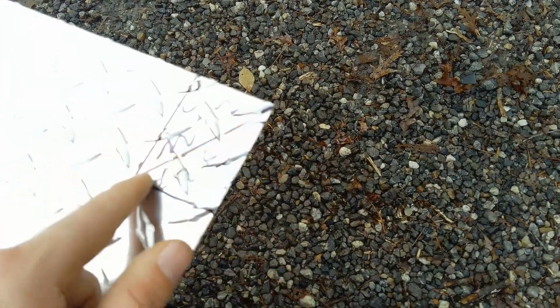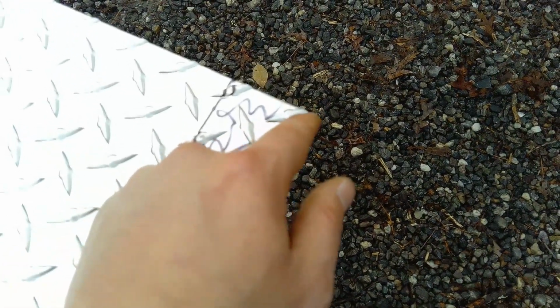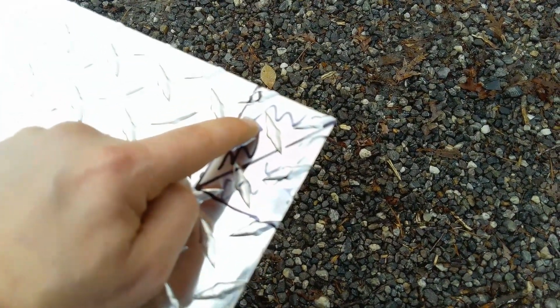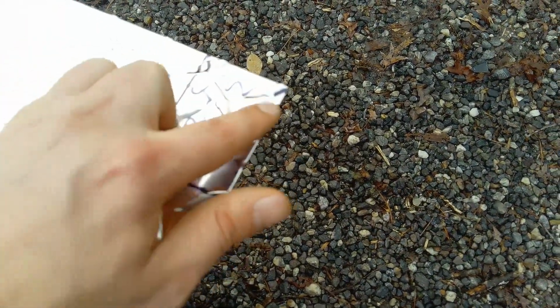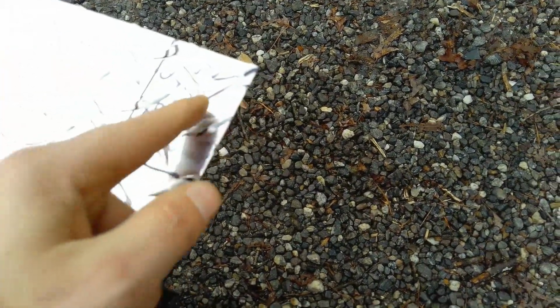And then I did a diagonal, which would be 45 degrees from the tip of the plate to the corner that I had just drawn. So this area here will actually be removed so that when this front panel folds, bends down at a 45-degree angle, and this whole section bends down at a 90-degree angle, this will meet up with that edge, and I can put a little solder, weld, whatever it's called, on there.